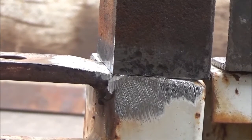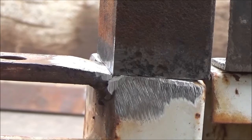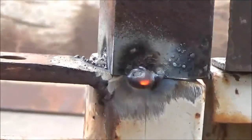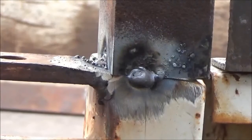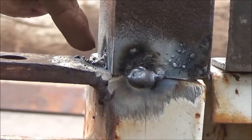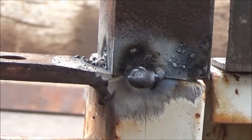In your second pass you've got to clean all your flux off because it'll weld right on top of the flux. But it will help me get a tack started, and that's all I want. Then I'm going to change rods to a 70-18, a bigger rod, and go ahead and weld the whole thing up. This is a 3/32" rod — it's a small one. That's all I'm going to do for my tack, and then I'm going to weld up on the inside because the tack's going to hold it out here.